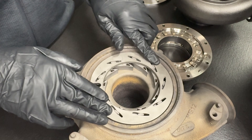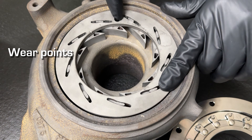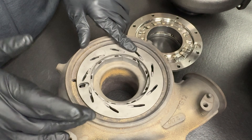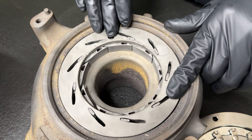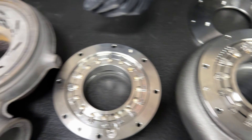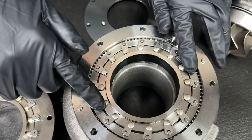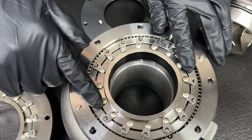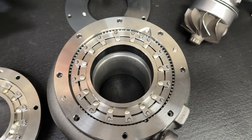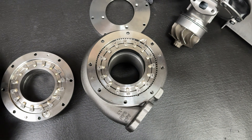They have to have that gap so they don't bind. But over time, this is one of the wear features, as well as the pin that drives this, because as soot gets into these systems, they naturally get more gritty and hard to move. With ours, if you see how this moves — just listen. No noise, smooth as silk. The ball bearings do a phenomenal job and the wear factor goes up about four to five times higher than without the ball bearings.